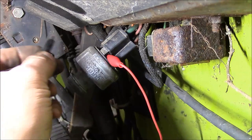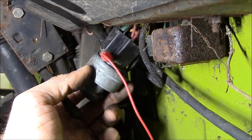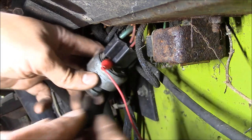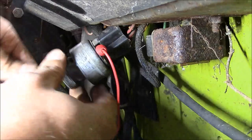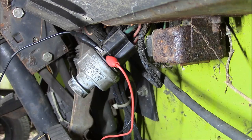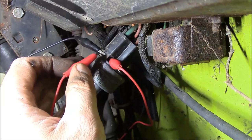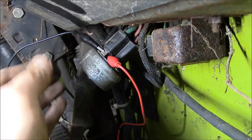All right, change of plans. I couldn't find a diagnostic paper clip that fit quite the way I thought it should, so I'm just gonna stick this plug back on, and there's plenty of terminals sticking out, we'll just use a few jumper wires here and should be good to go. So that's ignition, we'll hook that up to battery. Hey, a light just came on and I heard a relay click. So now this one's hooked up to the start terminal. It should crank when we touch this. And it does. All right, wiring solved.